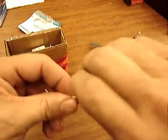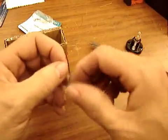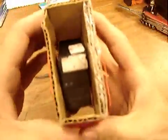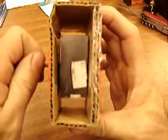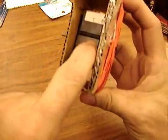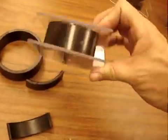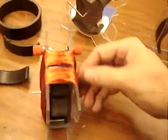Twiddle the wires solidly together. Lots of twists. Or solder it if you have a soldering iron. Now this one I've put little spacers between the magnets and got it well centered so it spins very nicely in there. I used little plastic spacers, little pieces of cut plexiglass. Now if you want to get fancy, cutting rings of black ABS sewer pipe, plexiglass, end up with something like this. Much classier version of the generator.